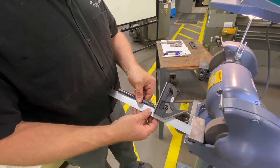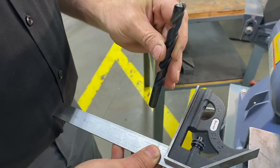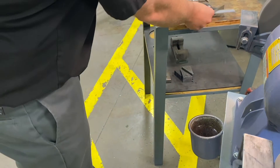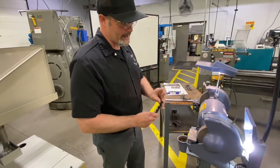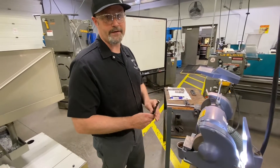I'm going to verify it on my square to make sure it's flat — and it's pretty flat. So this is the first stage of creating the flat bottom drill: getting a nice flat end perpendicular to the margin. We're ready to go to the next step.